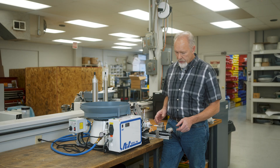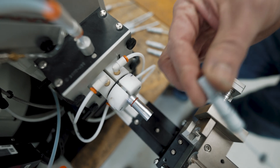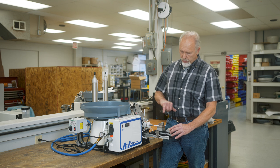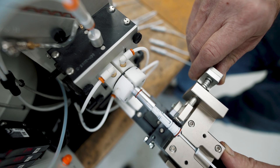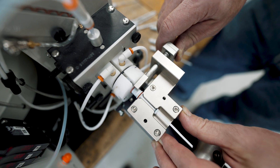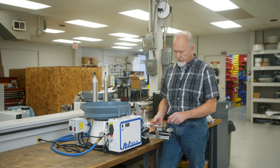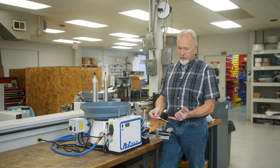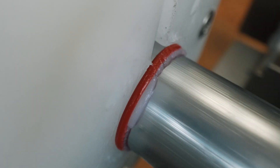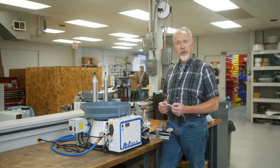We have this slide here — you just pop their part into the shuttle, and by pushing it in you get the first O-ring on. For the second ring, you simply push this little finger into place, and that guides the O-ring into the second groove. Now we have our two O-rings in place, and it's pumped a small amount of grease, which is adjustable, so this part can now be inserted into the next component.